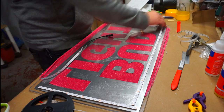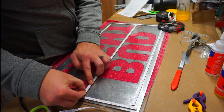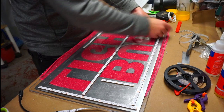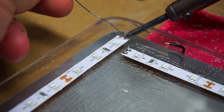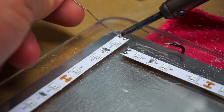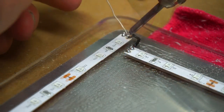There's nothing magical about working with these LEDs, but one thing you want to be sure of is that if you're going to make non-continuous runs, make sure you cut only on the indicated places to cut. Now it was time to solder all the connections together. I got out my soldering iron, some wire, and a hot glue gun. I put a bead of solder on each of the connection points — the idea being that I would take the open-ended wire connections and heat up the solder around it so the solder would hold the wire in place.